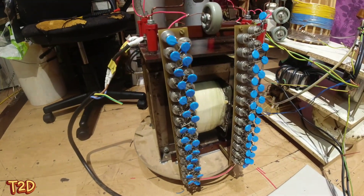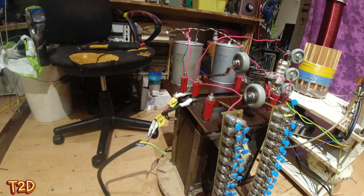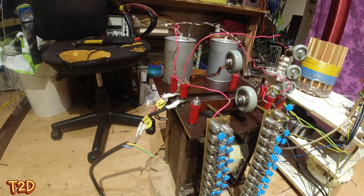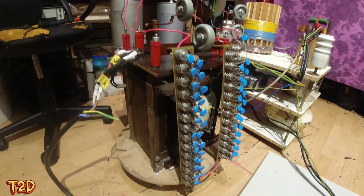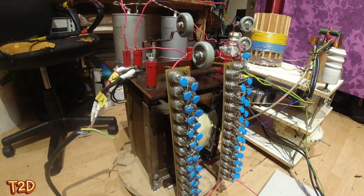So I've got this up to 5kV now — 240 in, 5kV out. What I was originally using was a string of microwave oven diodes at the top here, but they weren't really strong enough and they were getting very hot. So I replaced them with these monster diodes — these are 10 amp, 1.6 kV each. As you can see there are two big strings on there, and they're also protected with MOVs.